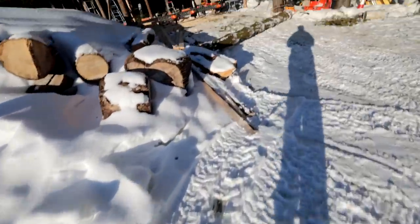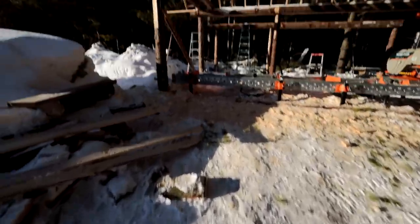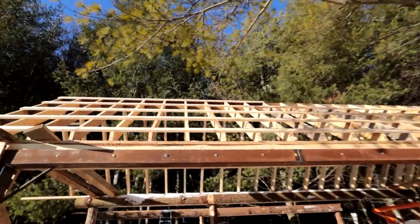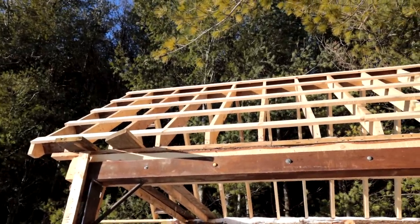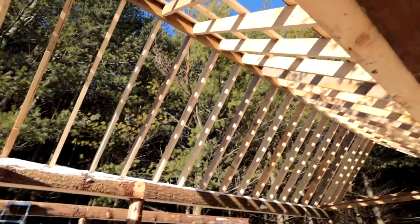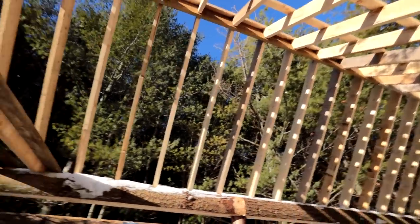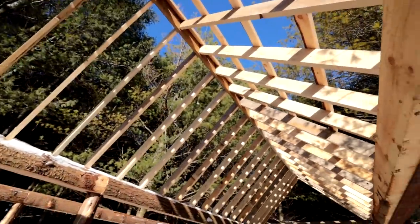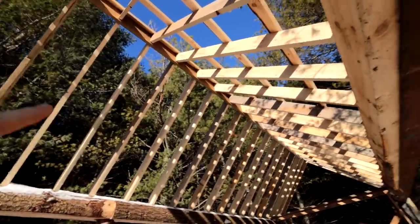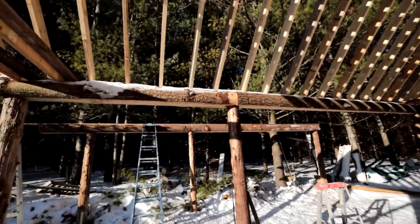I just got to mill these guys up. It's a good thing there is a sawmill, because otherwise if you had to buy that much material you're talking some big bucks. You can see our top - we got our strapping on, shaping up pretty good. That's all milled, that's one-by-four. Our gable ends are on, we've got our beam set, our top plate on. We just got to extend our roof rafters and we've got collar ties going up there. The reason I didn't add a center peak in the middle is because I had a bunch of seven-foot wood I wanted to use.